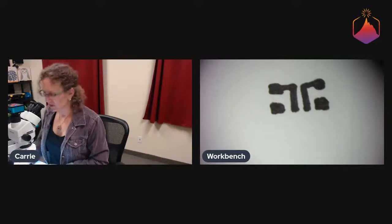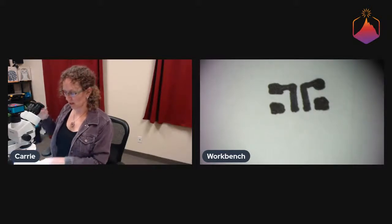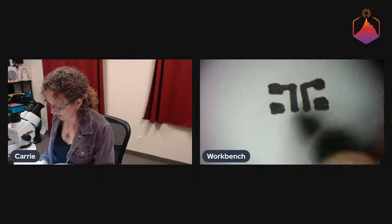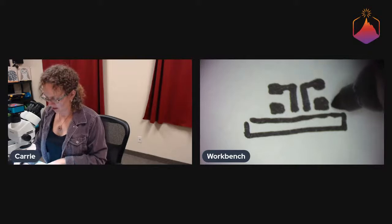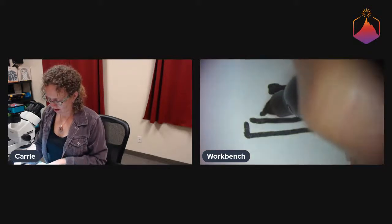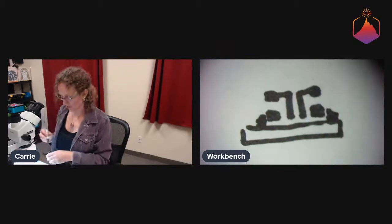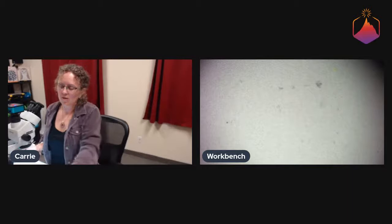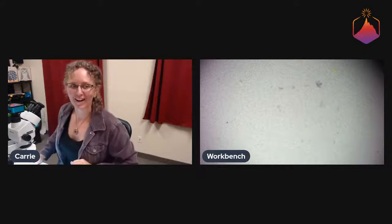So you don't want to do a big solder blob down to your pad. We're looking at it so that the lens is pointed down right now. If there were a circuit board, it would be right here, underneath it. So when you're soldering these, you want to make sure that you only solder here and that you don't accidentally blob up to that top pad. So those styles are a little bit trickier to solder, and I don't know that I would do that as a soldering kit unless it was an even bigger hacker challenge.